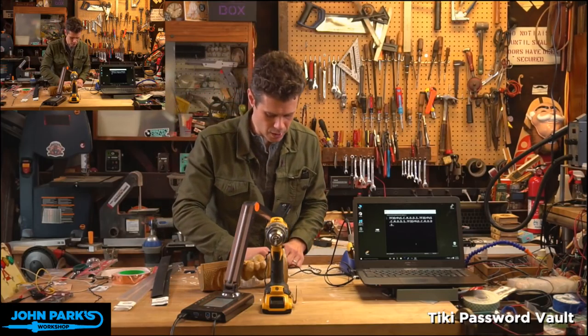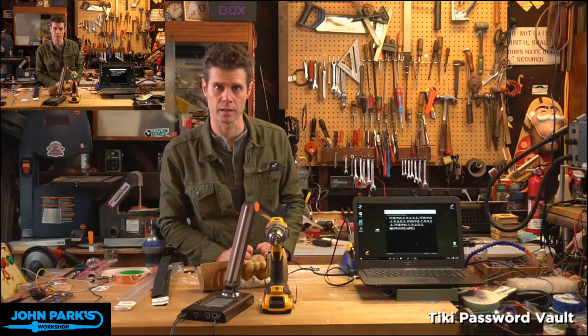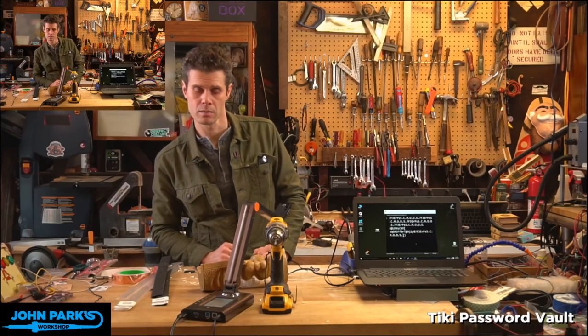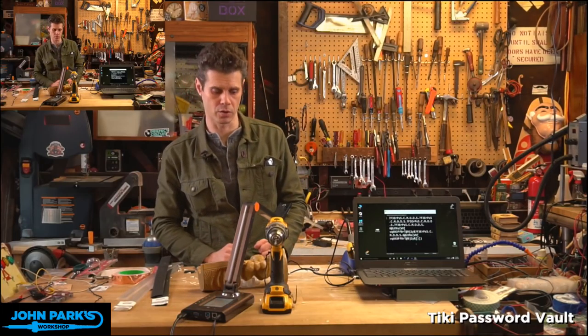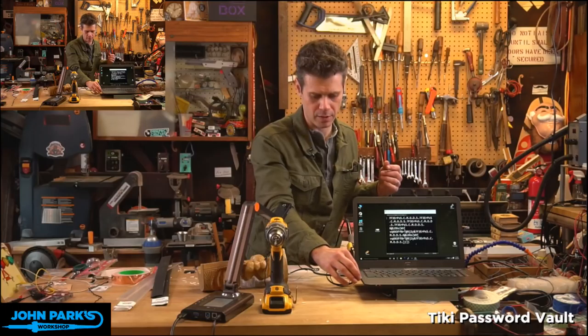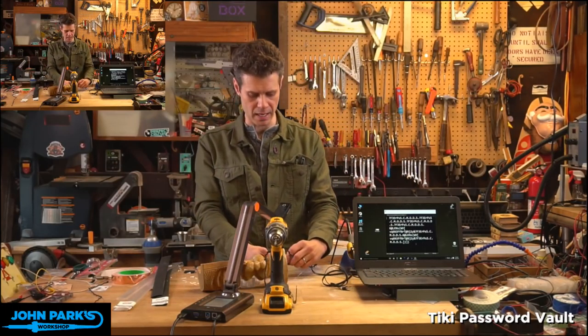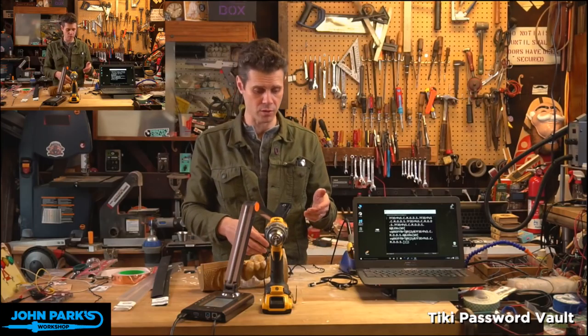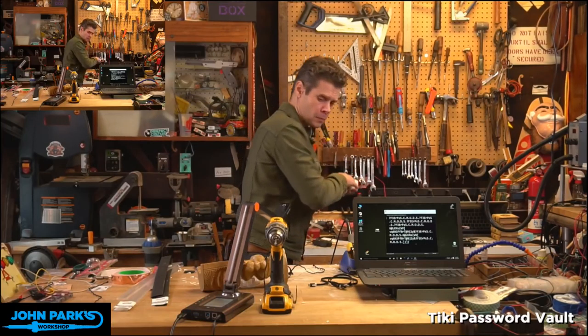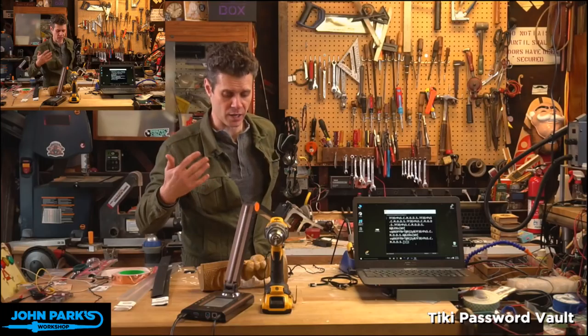Nope. All right, let's hit reset. Okay, maybe that just calibrated. So now I'm gonna touch a wire and it just entered one. Another entered the other. Okay. That seems marginally good. Yeah, I don't think having those wires crossed worked well. So we'll plow ahead. This may end up not working this way by having these so crowded with each other, but I'm gonna embed it anyway and we'll see what happens. Another option, of course, would be to have pairs of wires running up and actual switches and not use the capacitive touch if it's just not possible in this constrained area to do that.